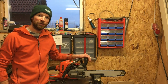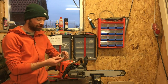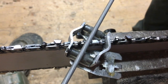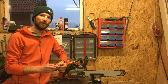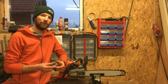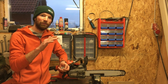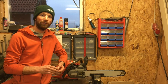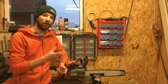I'm going to file this Oregon chain, which is essentially the same as a Husqvarna chain. Husqvarna has this style gauge with two little wheels that the file slides over — it gives you the right depth, and if you follow the angle of the gauge it'll give you the right angle. If you were to use this on a Stihl chain, it would give you the wrong results because they are slightly different in shape and height of the tooth. Other manufacturers like Stihl have their own equipment, so you need to know the size of your chain and the manufacturer.